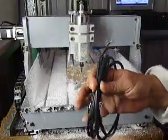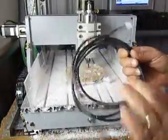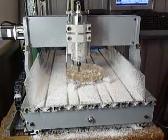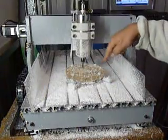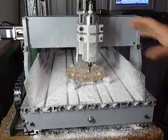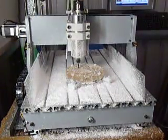The last problem was the spindle motor cable — one of the phases went open around the cable way for the Z-axis, right where it flexes. Because I'm using a mounting template here, everything happens in that one area. It kind of breaks down there in the cable way where it's getting all the action.